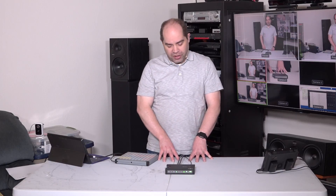Cons on the device — and this is kind of where we get into the reason I'm not going to be able to give this product a recommendation. First of all, the current firmware 4.4 series has a pretty serious bug where if you try and switch the video format from ProRes to DNxHD or vice versa, it actually freezes the device, and the only recovery is to flash the firmware over again. I've contacted Blackmagic support on that; they've confirmed it to be a bug, but it hasn't been fixed, and there have been three firmware update releases since I worked with them. We've gone eight months now without the problem being addressed.